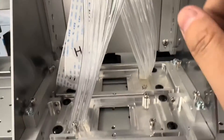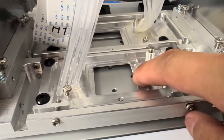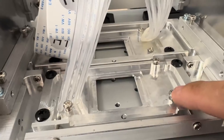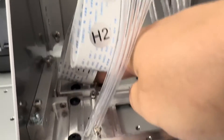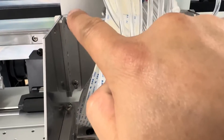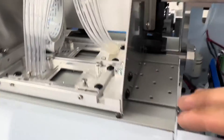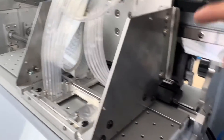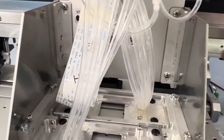Another misalignment is tilt — when the whole station tilts one way or another. This generally happens when you tighten the height adjustment incorrectly. The aluminum plate at the bottom should be the same height as the print head surface. To fix this, place four coins underneath each corner, loosen those four bolts, let it sit firmly flat, then tighten them back. If it still can't be made flat, loosen these screws as well, let it sit down firmly, then tighten those back too.